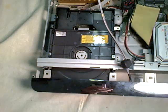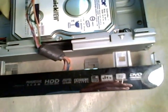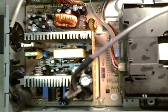You'll need to detach the connection for CN6 in order to remove the front face. That's done by gently sliding the tabs on either side out of the way and then pulling up. At this point, the front face of the unit is completely removed from the chassis, other than some of the cables. The DVD unit is still in the chassis, and I moved it forward as far as I possibly could — enough to get to the power supply board by moving the DVD player out of the way.